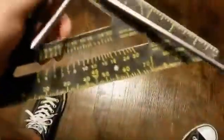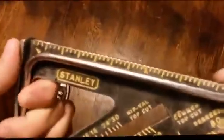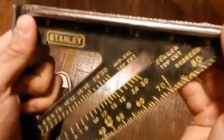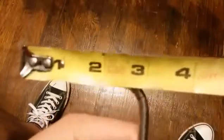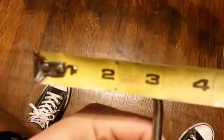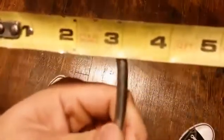There's your mark. Let's make sure it's squared — it should line up. It's a little past the 90; all you have to do is hold it and bend it back a little bit. So now if we measure it, the center of the tube should be at 3 inches. Put a measuring tape right here — right about there, it's 3 inches to the center of my tube. With tubing you're always working center to center, because that's where your measurements are.